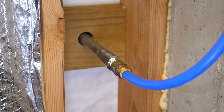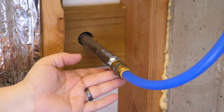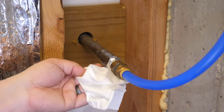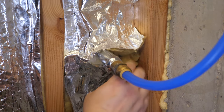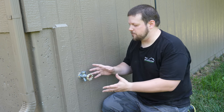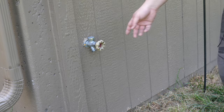We made sure the hose bib is turned off on the outside and we're going to turn the water back on inside and check for leaks. A good way to check is with a paper towel or napkin — you can easily tell if any water is coming out of the connection. We'll leave it for about five minutes. There's no water, so this is a nice solid connection with no leaks. This whole issue could have been avoided if proper blocking had been installed between the studs when the house was built. Hopefully this helped — if it did, please subscribe to The Top Homeowner channel. It works!